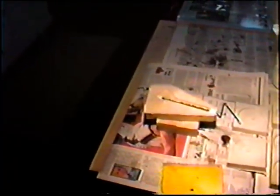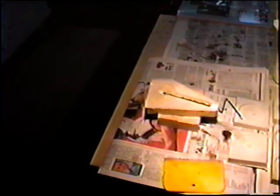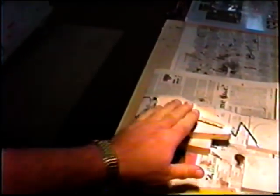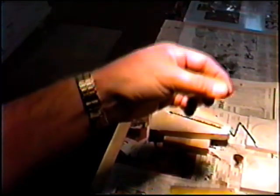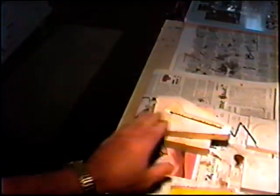I'm going to use my little system here that I have. You can see I have a heat lamp, the same thing you have in McDonald's to keep the French fries warm. What I want to do is heat the resin just a little bit and let the mold warm up just a little bit. You can feel a point at which you can feel heat, and that's the height. You just lower or raise the lamp until you get the heat that you want.